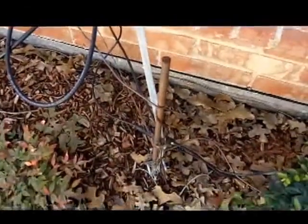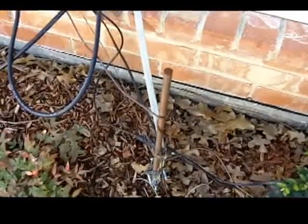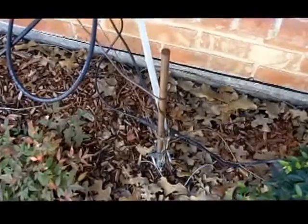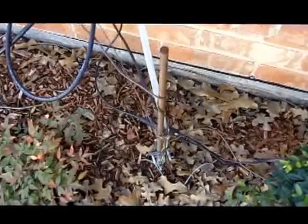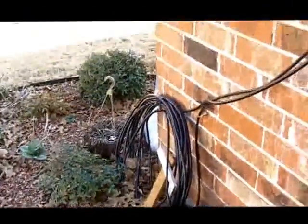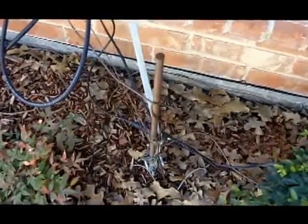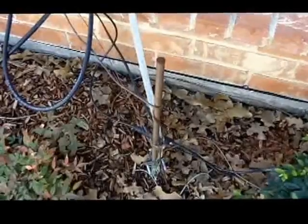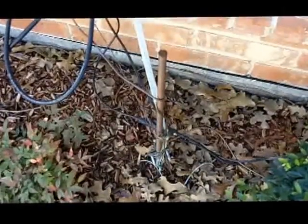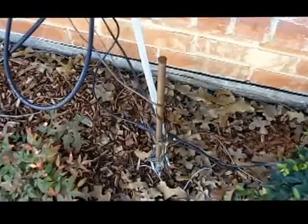Basically, I drove a ground rod into the ground eight feet down — it's a ten-foot ground rod — and then clamped braid to it. I've also got a six-gauge copper wire, uninsulated regular grounding wire, attached to this ground rod. It runs under the flower bed there and around the house as far as I could get it — until I came to the driveway and didn't want to go under it. It's probably about 50 feet of that, running around the house on the ground.